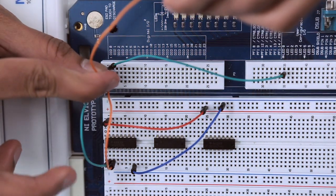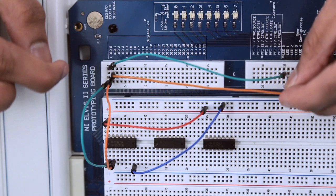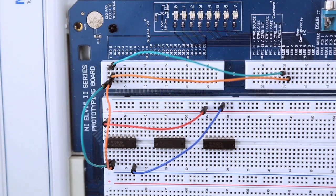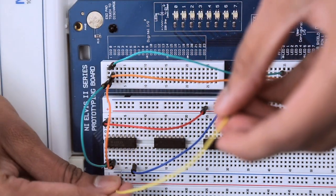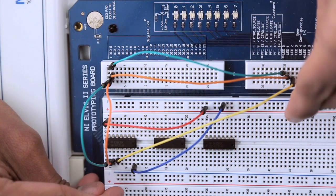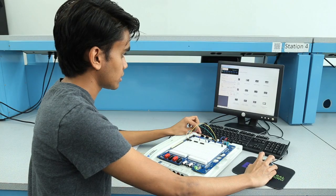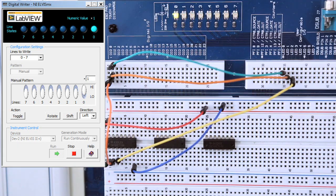Similarly, we're going to run one wire from DI1 to the second input of our AND gate, which is pin 2 on our chip. And just like before, we're going to run another wire from DI1 to LED1 so we can know when it's on and off. The last step is to run one wire from pin 3, which is the output of our gate, to LED2. Let's test it — turning DI0 on results in LED0 turning on. If we turn both DI0 and DI1 on, LED2 turns on since both inputs are true.